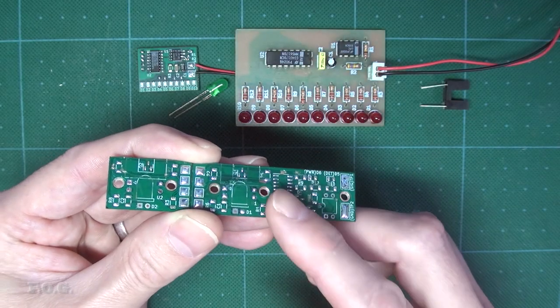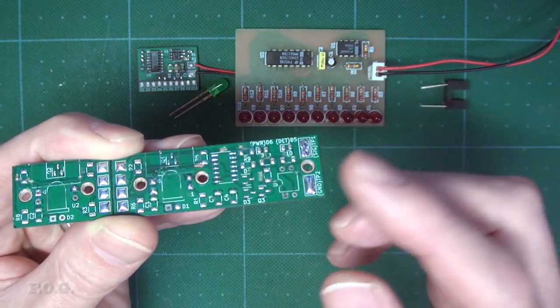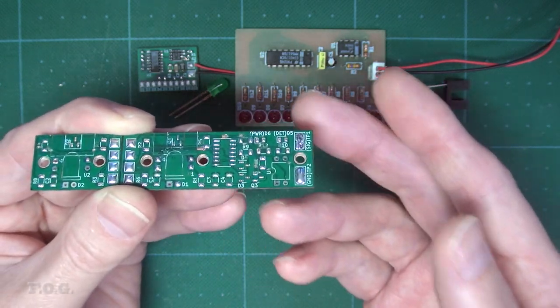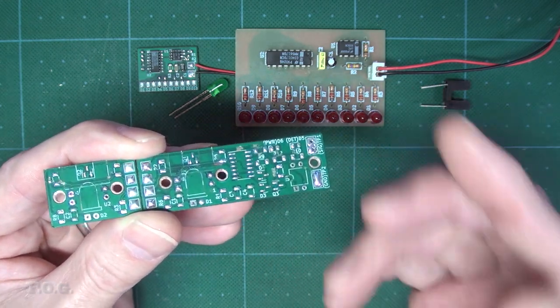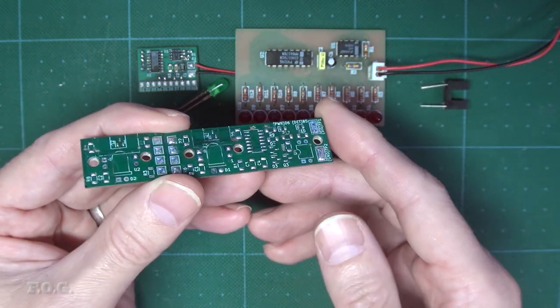So of course the white UV resin is not conductive. It is actually the green UV resin mask which I'm burning with a laser, and it's turning into a conductive path. Actually, I remember seeing a Louis Rossmann repair video once, where one of his staff clearly stated that all burnt resin must be removed from a repair site as it becomes conductive when burnt. In hindsight, clearly that was great advice.